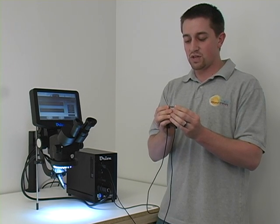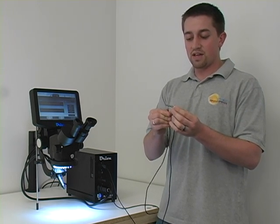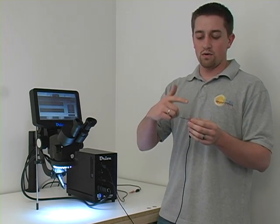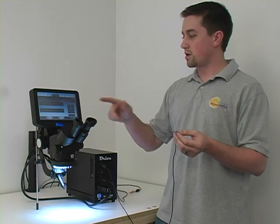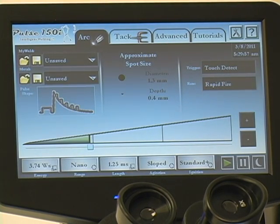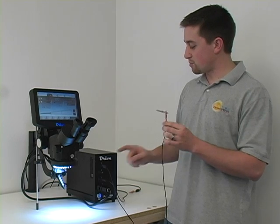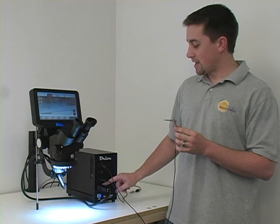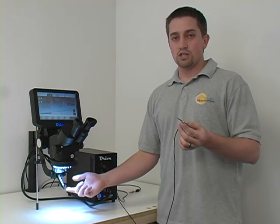So I'll go ahead and do that. Once you get it effectively aligned, now I'm going to demonstrate how to use the arc mode to permanently make that a strong weld. I'm going to switch this into arc. Just some quick pointers on the interface. In arc mode, I prefer to use the touch detect, meaning I'm no longer using my foot pedal. It's all automatic — as soon as I touch my positive alligator clip to the electrode here, which is our negative contact, it's going to initiate the weld.